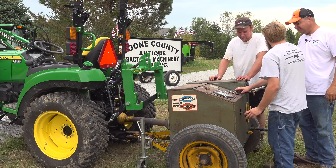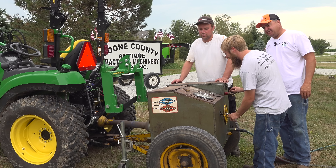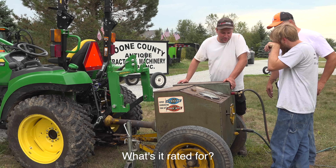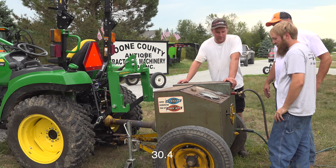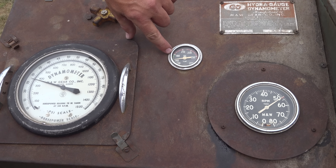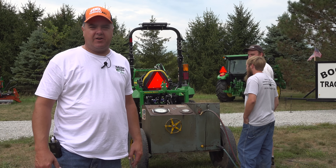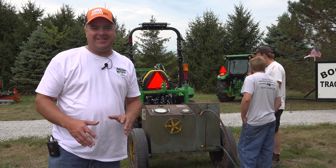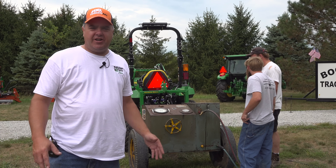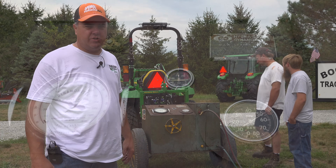About the same RPM. Readings came in at 75, 78, 82 — hey, that's over the limit. 30.4 — we're a long way from there, and you're already up to 10. With this tractor, we're seeing about 28 PTO horsepower. This thing was made in 1970 at the latest, and we really have no idea of the accuracy. It reads 28 PTO horsepower; it's rated at 30.4 PTO horsepower.